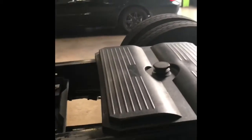Looking for the brake chambers. On the rear axles, your front axle, you've got a 30-30, which 30 is the standard size brake chamber, but that means that you've got your service side right here and your park brake side right here. So these are your service and park brake chambers for this front axle. There's one exactly on the other side. And the same thing over here, except minus the park brake. So that's just a service brake chamber right there. There's another one right over there.